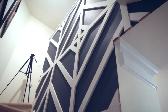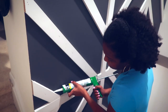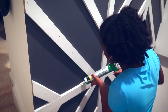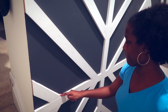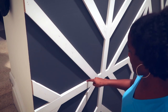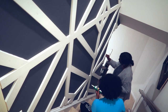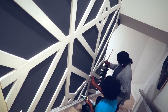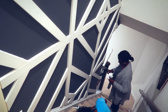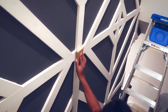This is what everything looked like prior to caulking. Caulking is not my favorite part but it does make projects look more seamless. I added a bead of caulk on all the edges and pulled in my mom to help fill the nail holes, which takes a lot of time. Then I wiped off any excess, and she used a hole filler on the nail holes. We sanded everything off to get it prepped for the final painting.